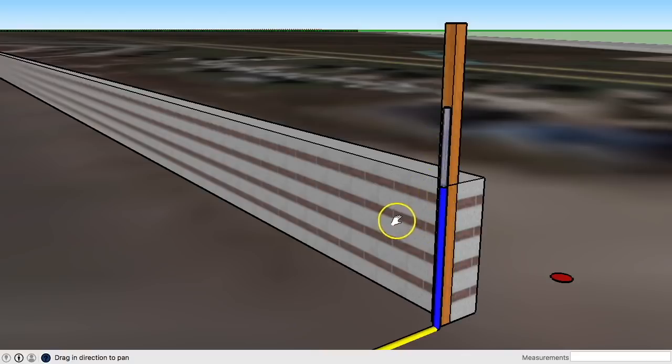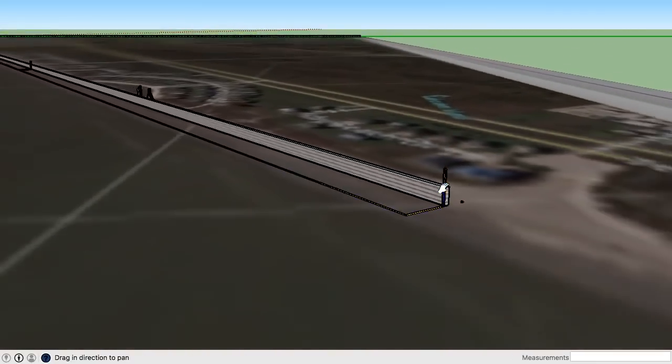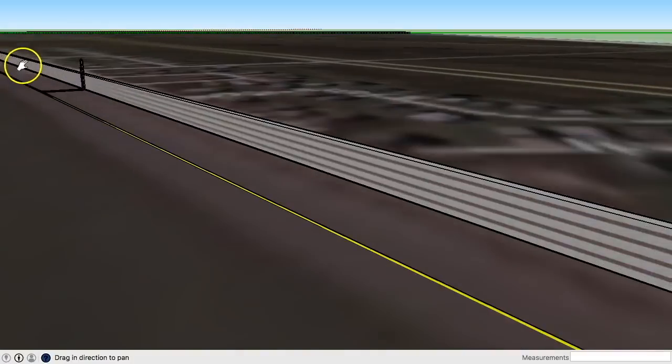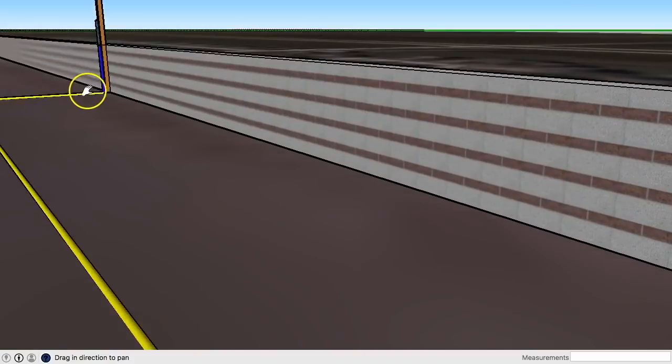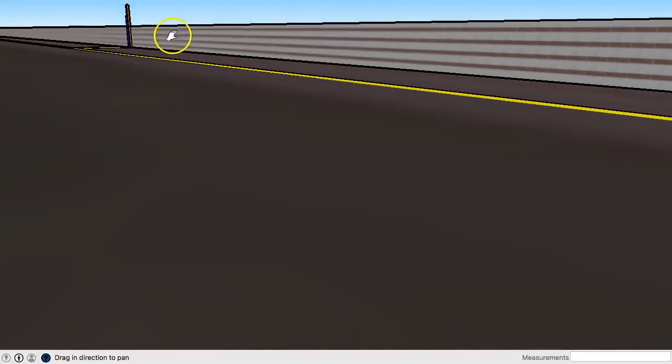And so what we'll do is pull up the hose along our post here, and we're going to set a mark on this post. First one. We're going to do a half mile at a time. So then we'll come down here. Same thing. We have the clear tubing. We're going to pull it up, and wherever the water comes up in the tube, we're going to set our level mark here and on our first post.